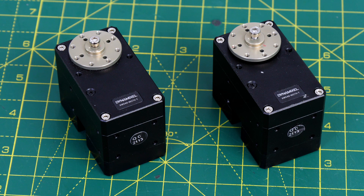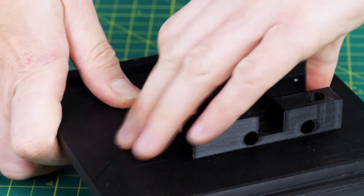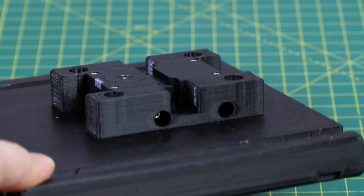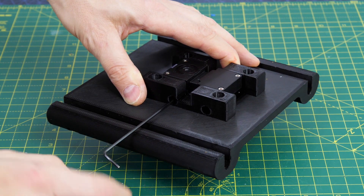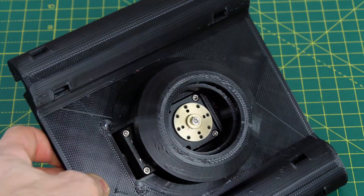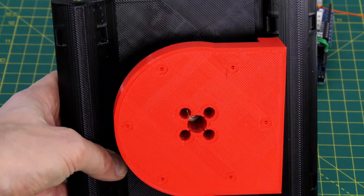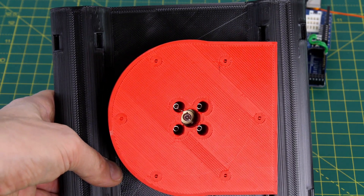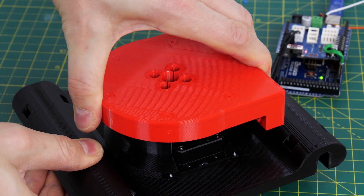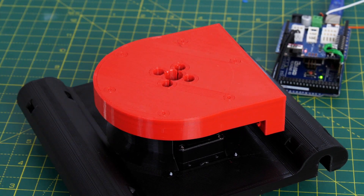The mechanism itself is going to be driven by two robotic servos. I've got two fairly chunky servos which fit into my other 3D printed parts — some blocks on the side with screw holes so that we can bolt the servos in place using the provided M2 bolts. The servo axis is right in the middle of my rotary part of the print. There's a bearing in the recess in the top of the black part, sandwiched between the black and the red part, and the red part is screwed to the servo horn with the provided screws, making a sturdy mount.